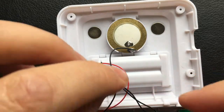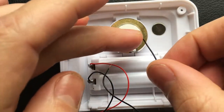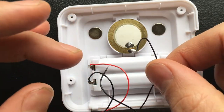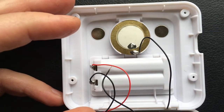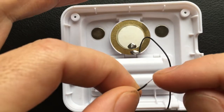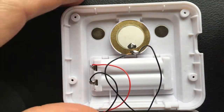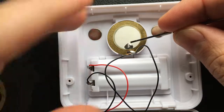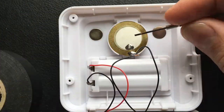One thing to note is that because I moved things quite a bit while figuring out how it works, the wires are very, very sensitive and I broke both of them. I'm not going to use the loud alarm, but I'm going to repair it. If it happens to you, just remove the insulation, make a scratch on the contact, cut a bit of tape, push the wire into the tape and into the end of the scratch, then tape it over. It should be working afterwards.